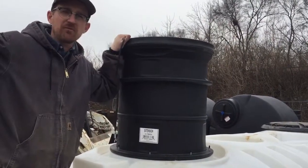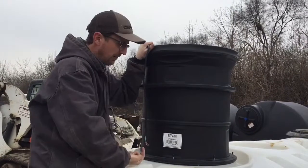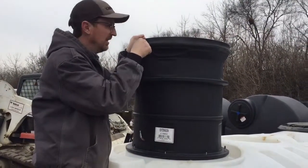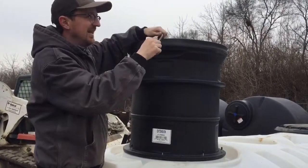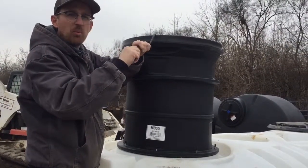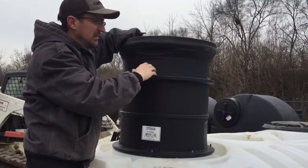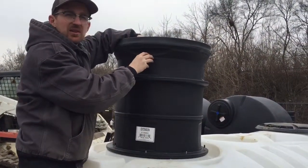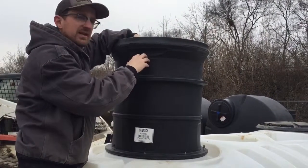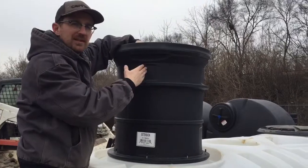Specifically, wire coming from inside the house to the tank: we run that wire up through conduit, into the LB, through the LB into the tank, and then use a submersible splice kit to connect that wire to the pump wire right inside the tank wall. All of that will be above grade so there's no risk of groundwater getting in, and you can locate the electrical entry point where it's coming into the tank.